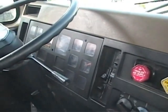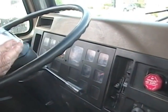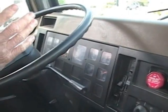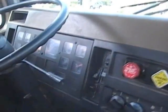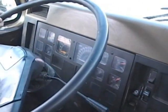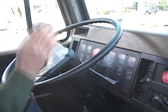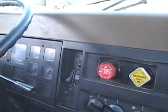Okay. The last portion of the brake test is your low air warning light or buzzer. That's a light and a buzzer that comes on if you're out on the road and you're losing air in the system somewhere. Gives you enough time to get over to the side of the road. So I'm going to turn the ignition to the on position. Okay, that beeping there is my oil water warning light and buzzer. It's got nothing to do with my braking system. So now I'm just going to fan the brakes down. I'm going to look on the dash for another light, listen for another buzzer.